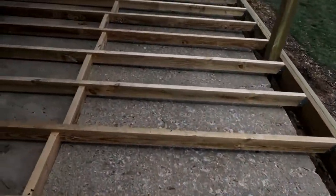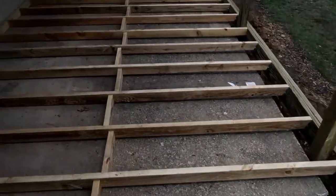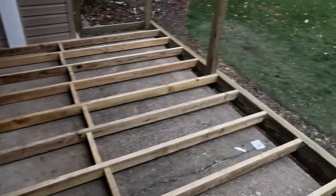She's officially framed in the best we can — we're ready to go get some decking. This deck measures a little over 19 feet. One of the golden rules on any deck project is to avoid butt joints. So we're making a run to an actual real lumber store — not a Lowe's or Home Depot — and getting premium 20-footers on the decking. That way this job will be quality.